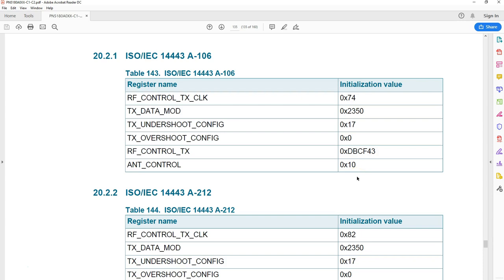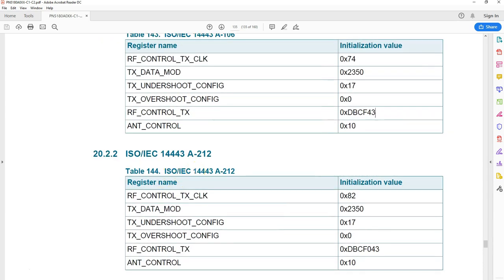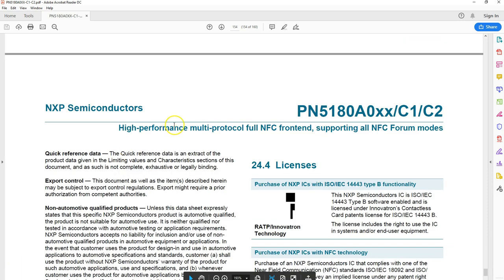So unless you are an antenna or electronic designer, it will be very difficult to make out how to get these bits. And if you go further up the document, you can see what these 32 bits of this register are. You just have to convert this to a binary number and find all those bits that are set and all those that are not set, and understand what exactly is happening there. Likewise, this explanation is given for every configuration you can load. And if you just keep scrolling, you will come to the end of the document.